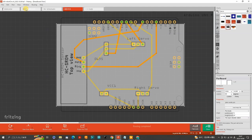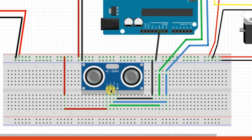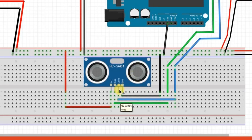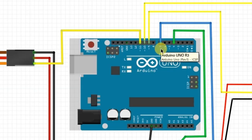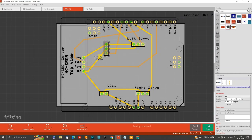Go back to the breadboard and you can see that all our basic connections are essentially the same. For example, trig from the HCSR04 is connected to digital pin number 4 on the Arduino, and echo is connected to digital pin number 7 — just like our PCB layout, which is in fact our perf board layout. I see I have the label for the SG90 upside down so I'll fix that by left-clicking the rectangle, right-clicking the label, and selecting flip/rotate from the pull-down menu.